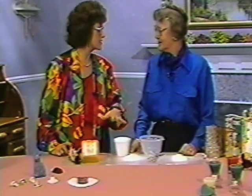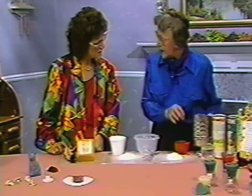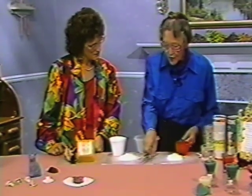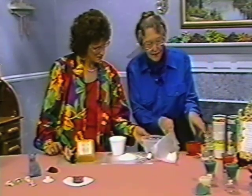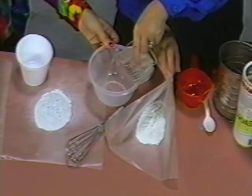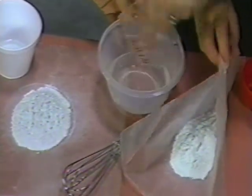Why don't we just do it step by step and show them how easily we can make this mold? The instructions for Instamold are on the back of the canister. Measure it — this is almost like baking a cake, you want to measure carefully. I suggest that you sift it, because in shipping it packs down, and like cake flour it works better if it's aerated. We are going to put it in our bowl here. You generally use two parts water to one part Instamold.